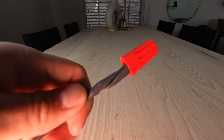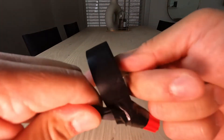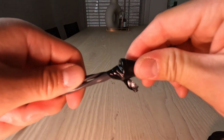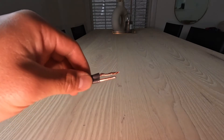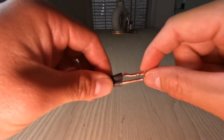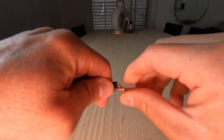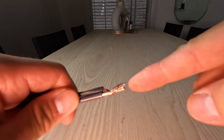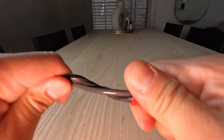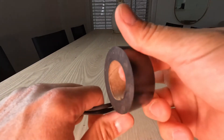Pull the wire nut — this is good. After that, put the electrical tape on and pull again — this is good. Here is where most people get into trouble: when trying to wire nut a solid wire with a strand wire. You want to have the strand wire about one-eighth inch longer than the solid wire, and that will fix the issue. Have the strand wire wrapped around the solid wire and make sure it's flush on top so the wire nut can grab both. Again, once you see the two wires starting to twist together you know you have a good grip. Do the pull test on each wire and pull the wire nut — if it doesn't come out, tape it up and we're good to go.